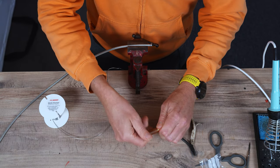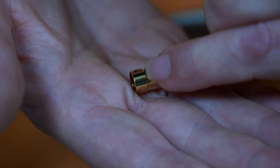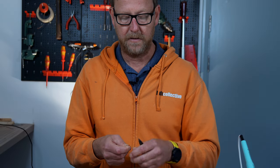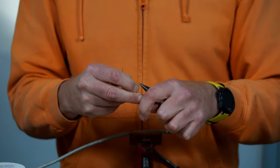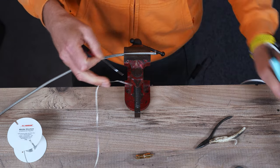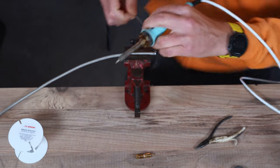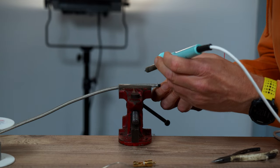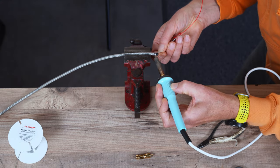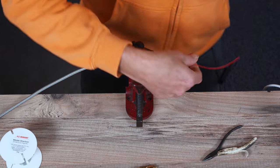This braid has to be wired into the earth connection, which is this bit here. So we need a bit of wire to connect that up. I'm just using a silver-plated 1/0.6 wire — put a bit of solder on the end of it. You don't want to make it too bulky. As I've said, you need to get it through the shell. Cut that off — that's prepped that end.